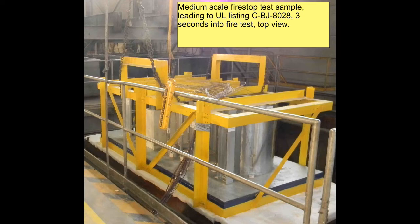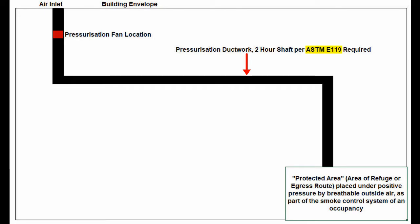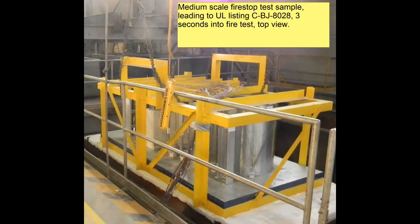Now in this video, I've indicated that the way that one might get a false impression from ISO 6944 and ASTM E2816 test results and listings, advertising possibly, and so forth, is that there is a mention of thermal performance. And the thermal performance comes in the way of testing basically by beating up on the fire stop. Right? So think about that. Think of how many lineal feet of a duct system you may have in a building, and how many lineal feet of that are going through fire resistance rated walls and floors at the point of through penetration. That's a minuscule portion of it.